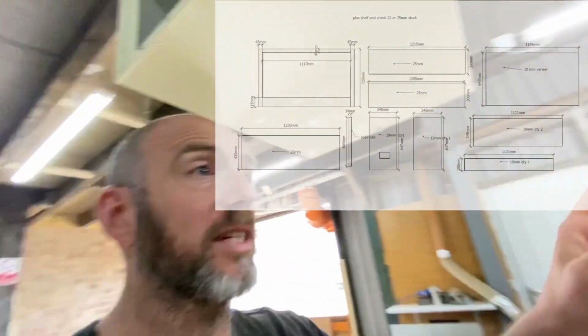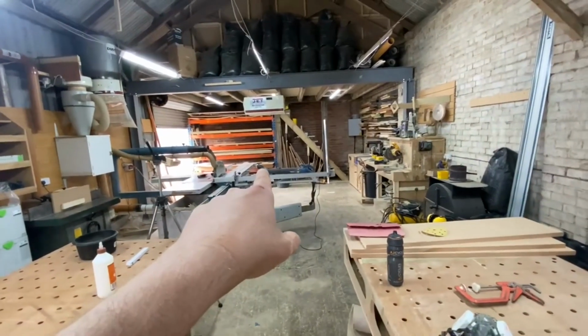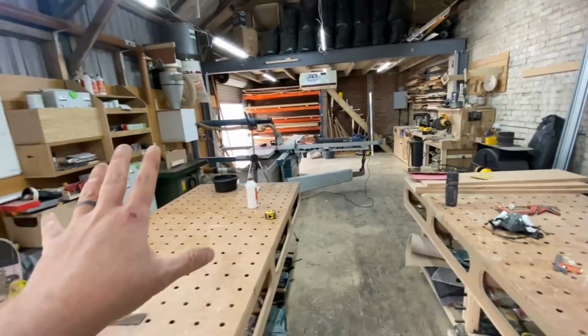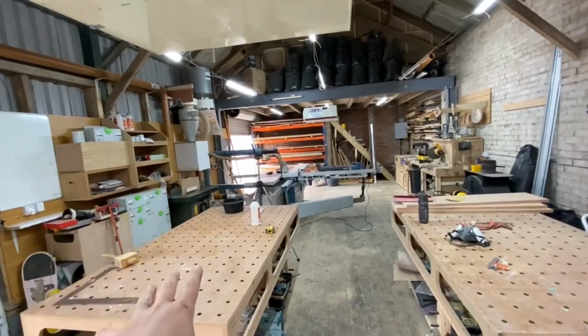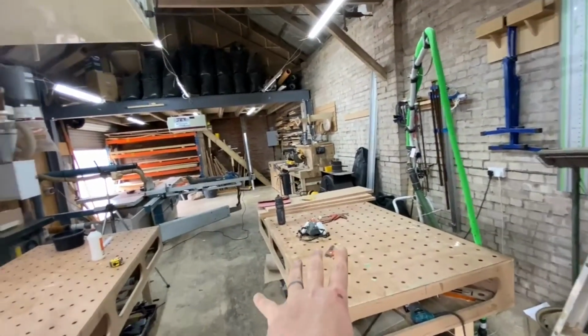I'm going to cut every single panel. I've got 9 veneer boards down there, so I'm going to cut all my veneer boards and stack them on the bench. I'll probably do tops, bottoms and sides on one side. And then tomorrow it'll just be dominoing and pocket holing, getting them all made, I'd have thought. It's just the maths that's really the hard bit.